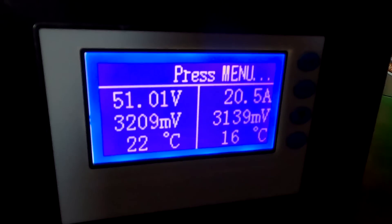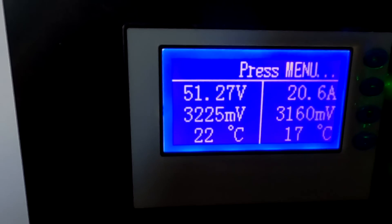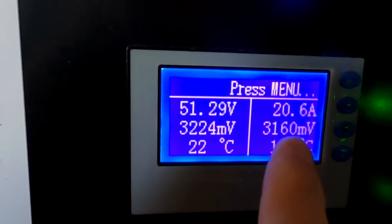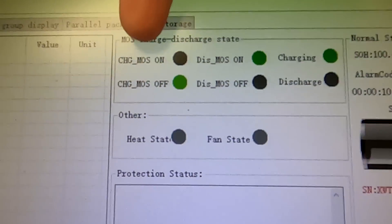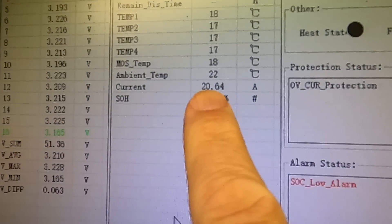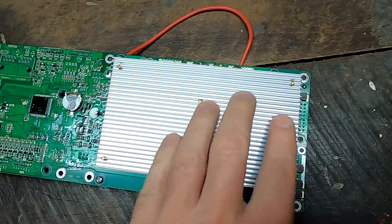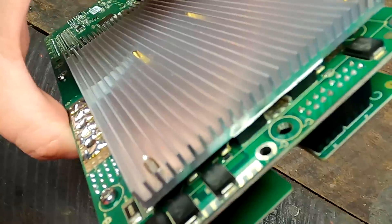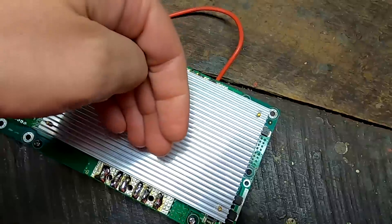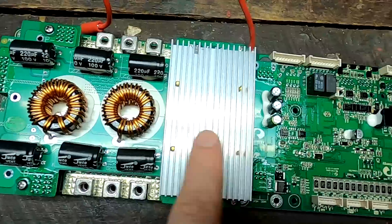Let's see how much current actually goes in — 15, 36, 20 — there it is, there's the limiter: 20 amps. This works as well in the QSO battery with the Tabaluga BMS — current limiter at 20 amps. While it's limiting charging to 20 amps, the software shows an over-current protection triggered and the charging MOSFETs have actually turned off, but it is still charging with 20 amps.